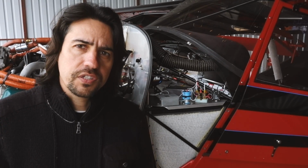As far as avionics goes, unless you're making an upgrade, putting in a new GPS or a new ADS-B, I like to make sure the wiring is nice and secure, the databases are up to date, and my checklists on the iPad and the Garmin G3X are also up to date.